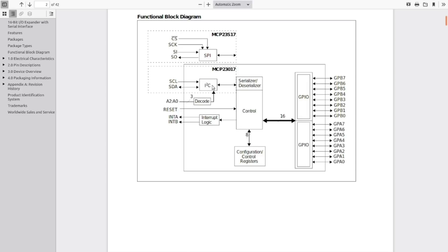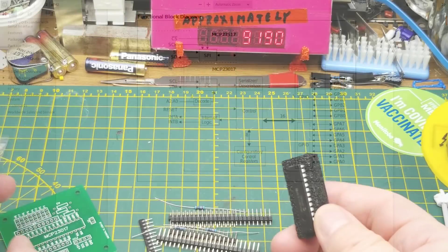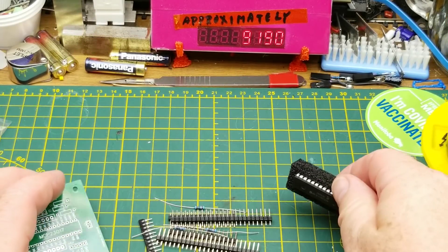There's the basic block diagram — serial data comes in, address decode for I2C, and it has a couple of interrupts it can send to the microcontroller so it doesn't have to constantly scan. It can just ignore it until something changes and flips an interrupt. The 16 GPIO pins are standard GPIO — no PWM, no analog-to-digital conversion, just standard I/O.